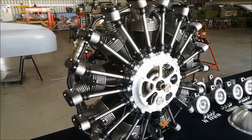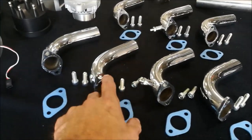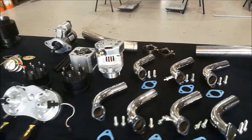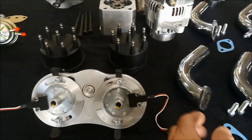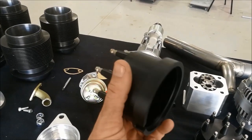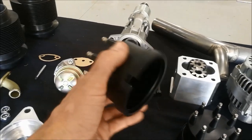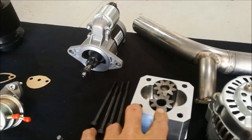We have a section of exhaust system which was removed so the whole engine could sit on the bench for display. The intake pipes have drain nipples on the appropriate lower cylinders. The ignition system is a dual hall-effect electronic ignition system with seven-cylinder chopper plates and custom seven-cylinder distributor caps made out of solid acetal plastic — used since day one. There's also the high-volume scavenge pump, which we've been using since 2005.